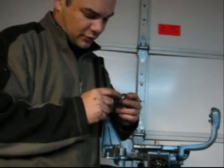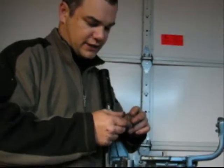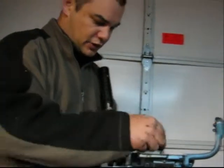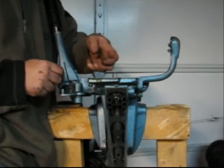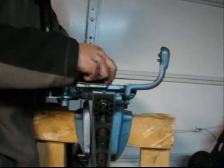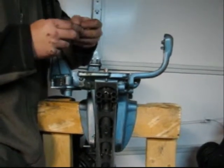I'm going to bolt the power head down — I want to do it as a test. Basically what happens is this first washer goes down on the top. There's a roll pin that sits through that shaft, so you catch that washer, then your spring, then your carbon assembly that goes over top. That didn't really work because my O-ring just popped off.